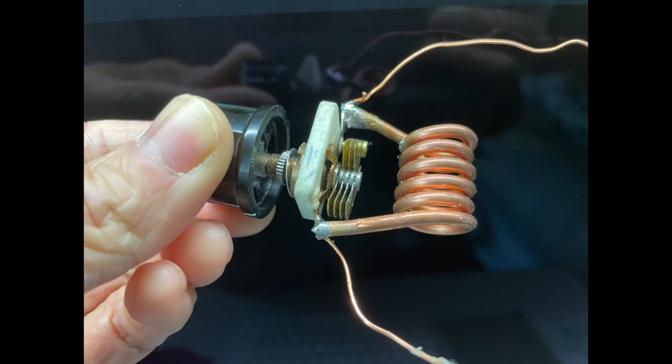The most important thing is that when you solder them together, don't use loose wires to hang them together. You must solder the coil directly onto the variable capacitor's terminal to avoid any signal loss. The soldering needs to be done perfectly. You need a shiny surface after soldering. Otherwise, it may inject some impurities that will increase the resistance and lower the Q.